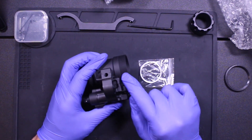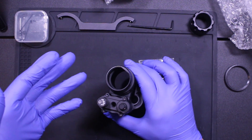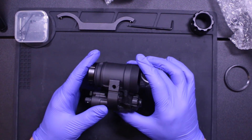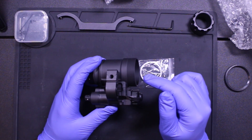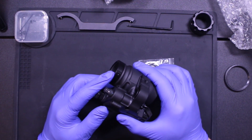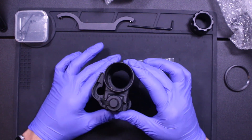What it does not come with is the rear ocular ring and also does not come with the grub screws for the D-ring. It does include a D-ring which is pretty handy for your objective lens, because if for some reason your objective lens gets broken and you need to replace it, you could simply unscrew everything and take it out in its entirety. Whereas with the traditional PVS14, you would have to disassemble the entire unit, including the rear lens, and take out the intensifier tube in order to reach the objective lens. But with the D-ring, you do not have to do that. However, what would have been nice is if Lowlight Innovations just included the grub screws, because after you assemble this, you'll have to screw the grub screws in here to secure both the D-ring and to set your infinity focus.